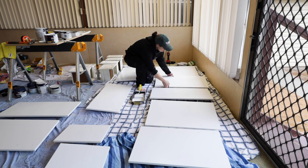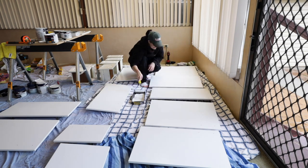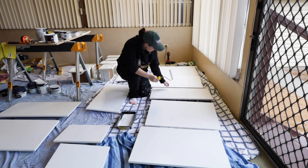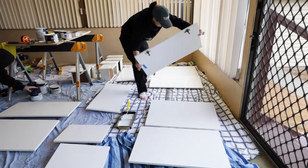Because we made sure we painted the cupboard doors first thing in the morning, it meant that we had already waited our eight hours, and late in the afternoon we could apply the second coat. It is the end of day two — we have waited our eight hours and we are up to the point where we can clear coat our splash back and our bench top. We're mixing up a clear gloss for the splash back and a clear satin for the bench top, applying that, leaving it overnight, and we'll apply our second coat tomorrow morning.